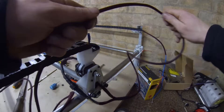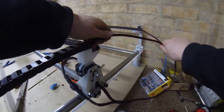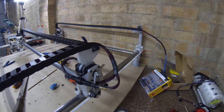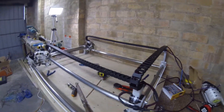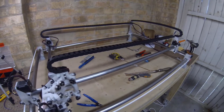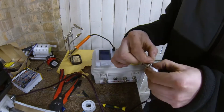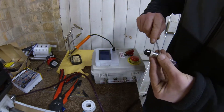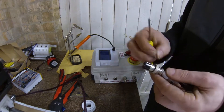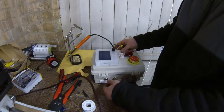With all three cable chains installed and a rough idea of where I want them to run, I then ran through the last of my cables out to the back corner. Here's a quick overview of the machine in its current configuration — which is really the beauty of this mostly printed CNC, you get to make it your own machine. Here I'm wiring my first aviation connector for the Y axis going into the junction box, which will allow me to test the Y axis, then I'll wire the rest of the axes the same way and hopefully I should be up and running.